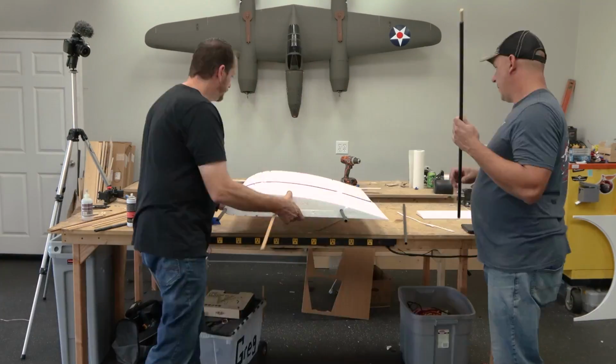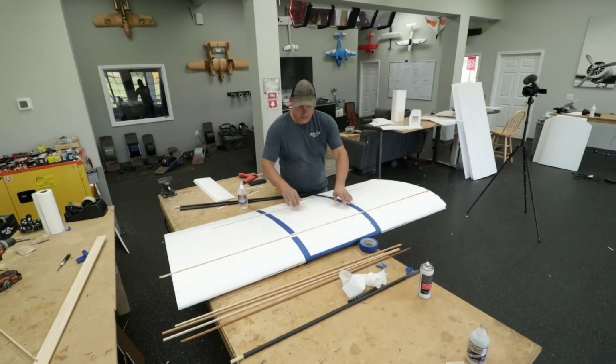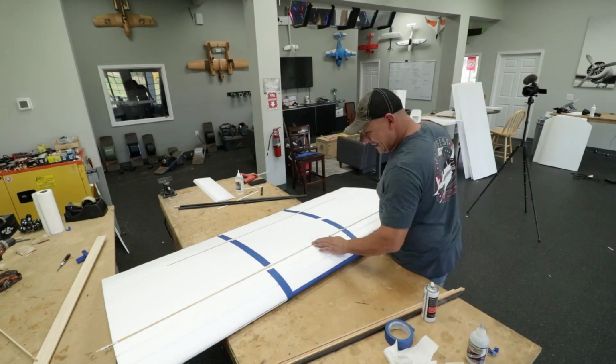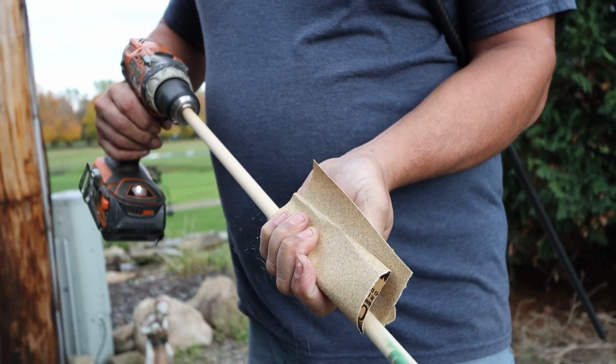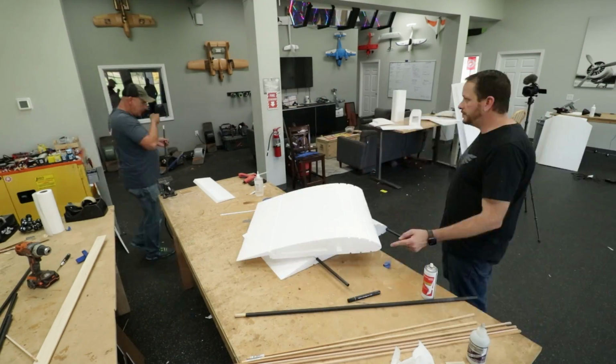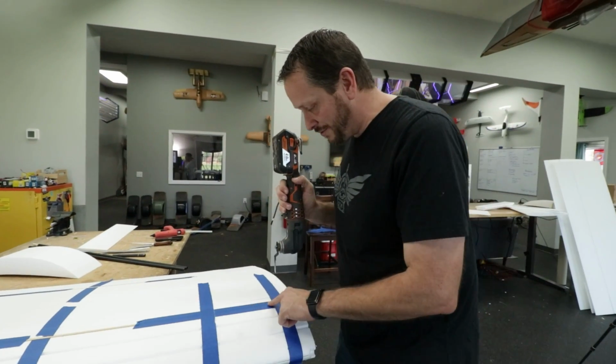So the plan for this wing is pretty simple. We're gonna have a center section to the wing that's gonna hold our 2 motors. Then the outboard panels of the wings will simply plug in. One connection for the ailerons is all you need. And Dave is gonna make a cool joiner for our carbon fiber tubes to keep that strength running throughout the whole entire piece of the wing. So we're cutting in our motor nacelles right now. We gotta cut through these spars here.